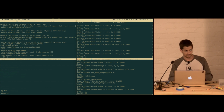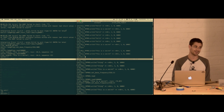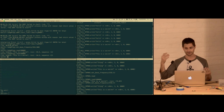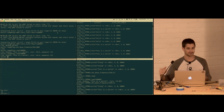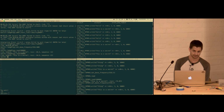It's kind of interesting to me, at least, that on the right side, we're talking to these RFM69HCW chips. On the left side, we're talking to these CC1110 chips. They're different manufacturers, different specs. One of them requires special firmware. The other one is almost infinitely configurable. And yet they're talking to each other just like they've been friends their whole lives. So that's kind of where I'm at. I've got it all working well enough. Some of the timeout logic is a little bit flawed.